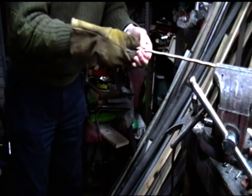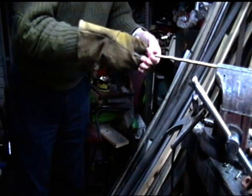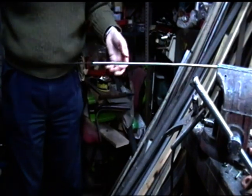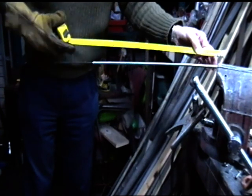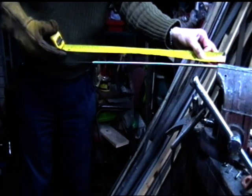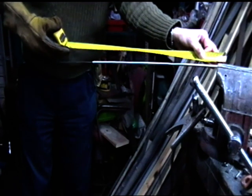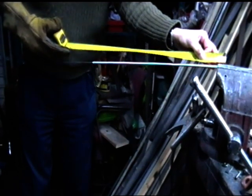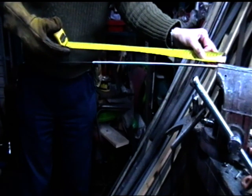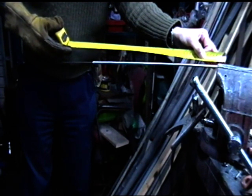So I know I can close that up, hopefully, and I'm hoping it won't go back down to its original. See, just pushing that in again has now put that back to 19 inches. So the spring is not very happy. I've had it out to over 20, but pushing it back in and closing it has deformed it back, and it's lost an inch.